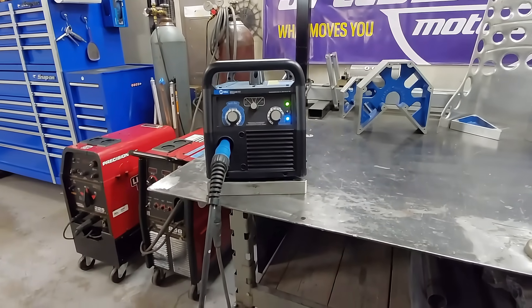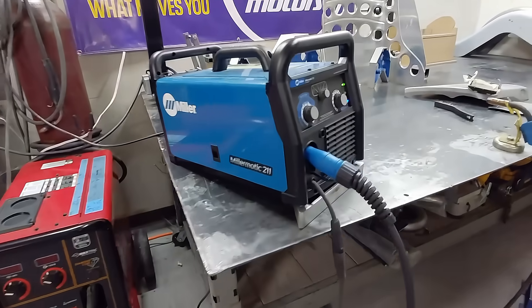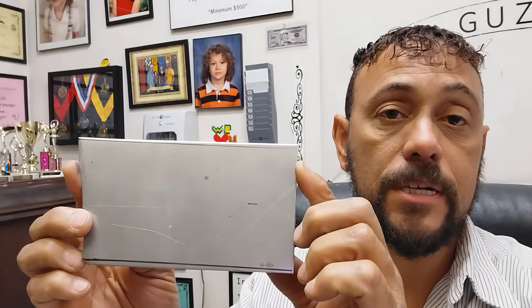If you're in the market to buy a welder, that is something to definitely think about — the newer inverter welders all have this feature; the older ones don't. I did a video on the DP200 yes welder — very budget-minded, awesome little welder — there is a discount code if you follow the link in the description. Now let's discuss some considerations: am I going to be welding in a 1G flat position, 2G horizontal, or 3G vertical? Am I going to be butt welding or lap welding? One welder setting for wire feed speed and voltage isn't going to cover all of those joint configurations or welding positions.